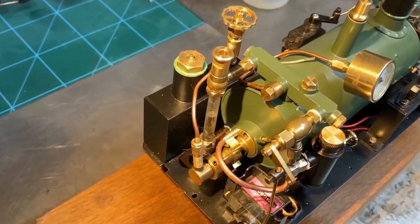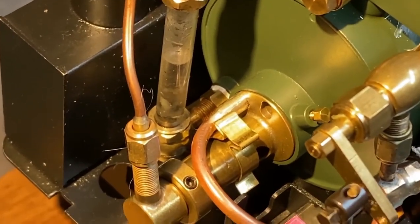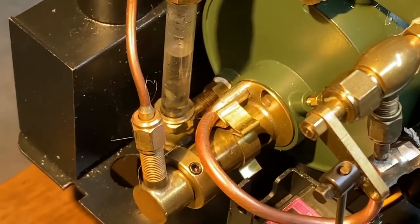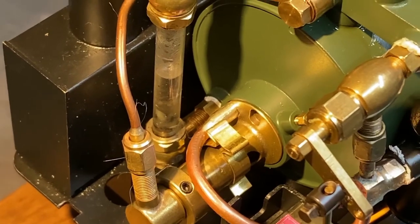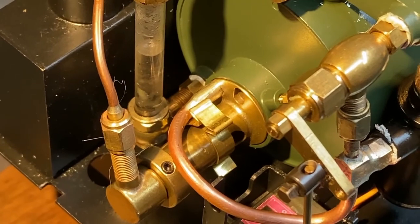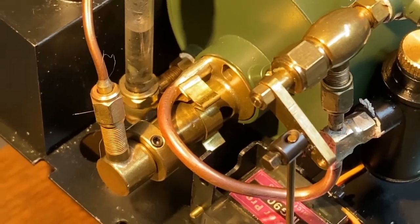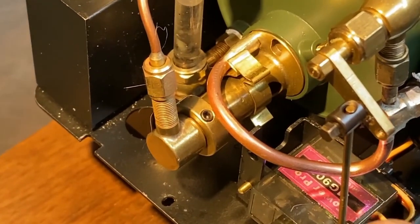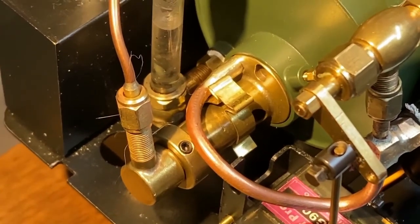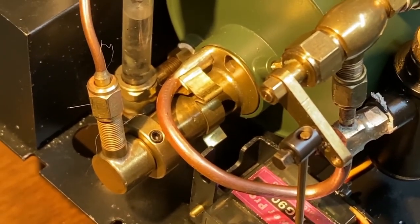While I'm waiting for it to get up steam, notice that this is where the copper pipe goes through the burner to become the superheater — that's the bit I broke earlier today. It was actually badly made by Regner; there was only about half a mil of copper inside the stainless steel bit. So I've replaced this pipe here with a different piece, making sure it went well inside the stainless steel bit before I silver-soldered it back together.